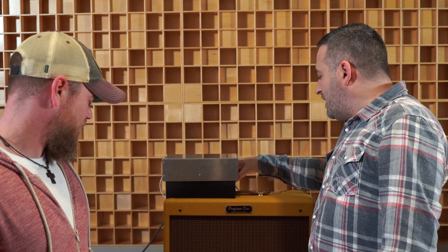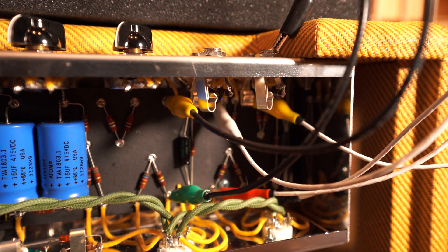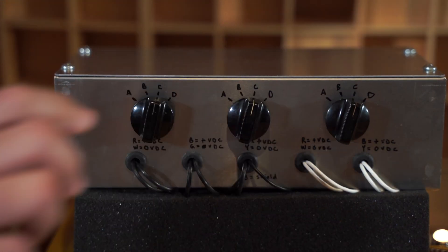So they all might have a different sound — that's why we're going to do this to find out. What we've done is I've got flying leads here that are shielded and they're connected into the amp at the various points where the capacitors normally would be, and the capacitors are switchable. So we'll be switching to each one and looping the same audio every time. That way the audio stays the same. I don't know if this is scientific, but at least it's somewhat controlled. We're at ETSU today, so we need to be at least almost scientific. These samples will be very repetitive and very short because if the samples are too long, the brain kind of forgets the way that the sound was. So we'll be doing a lot of very annoying short samples.